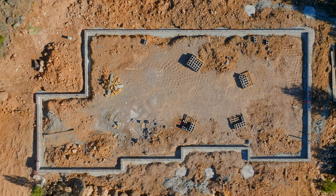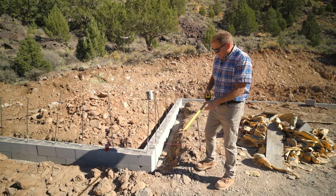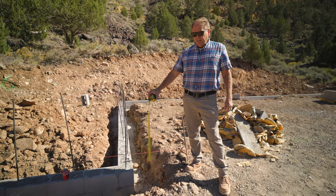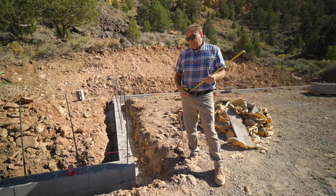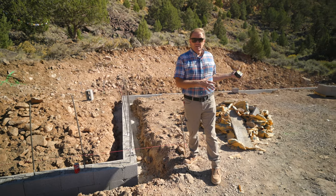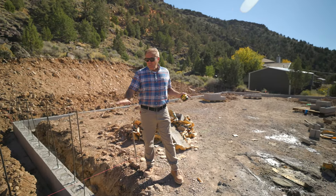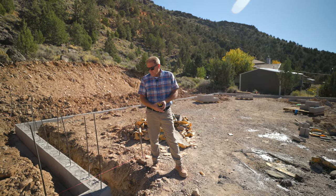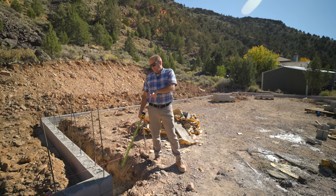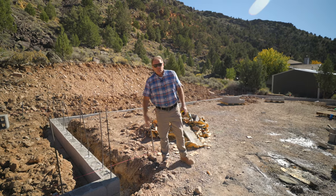This will accommodate for the 30-inch frost depth that I need, which is right about here. So when you add it all up and I go 12 inches down from my footing, and then I have my block, and then I have my slab on top of that, I've got my frost depth all taken care of. But the neat thing is we can get the plumbing in here, get it all trenched, then grade everything all the way to the foundation. We'll do a 9-inch turndown, so we'll actually slough it off just a little bit so we'll be able to bond to this wall.